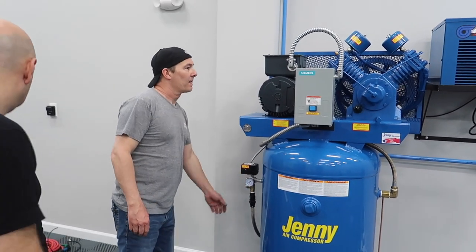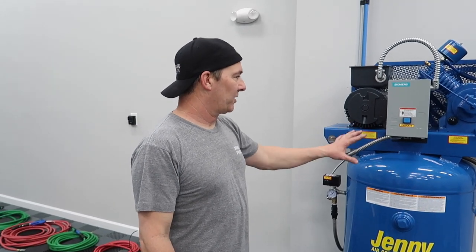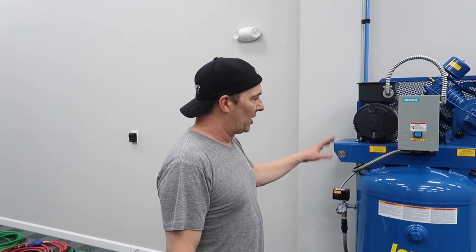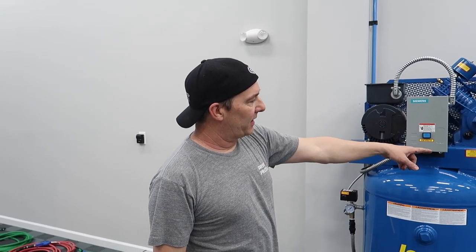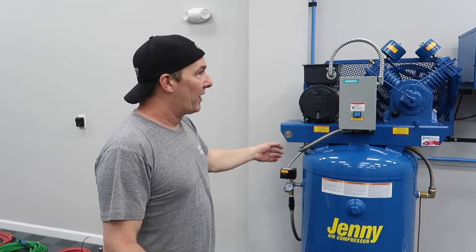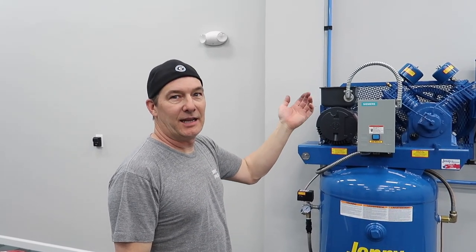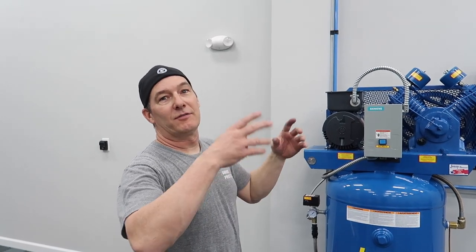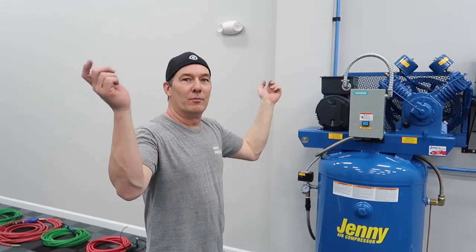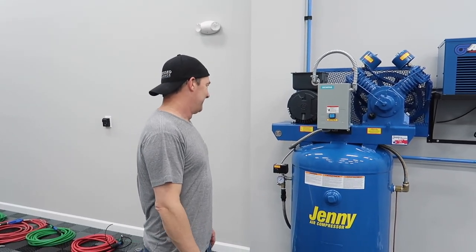So what were you saying about leaving something open so we don't explode the... Well, we'll just pressurize the compressor, right? Yeah. Get it up to operating pressure. Take the regulator all the way down to maybe 20 pounds. Open the ball valve, pressurize the system to 20, and then creep up on it, 20, 40, 60, 80. That way, if we did forget to tighten a line, it doesn't just blow apart. We'll hear it leaking before we get the explosion, theoretically.